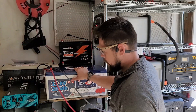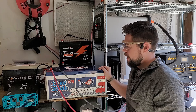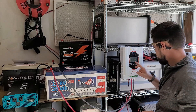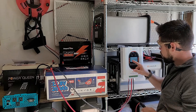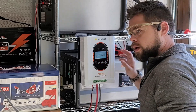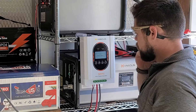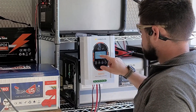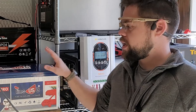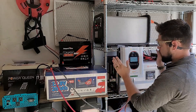Effectively, by having one — the battery — two — the inverter — and three — the charge controller — I've now made a solar generator, power station, whatever you want to call it. It's really that simple. I've got a single 200 watt solar panel connected here. On the screen I can see the battery's at 13.2 volts and no charge is coming in from the panels yet. I connect that — immediately I'm getting 19.2 volts. Now it's starting to bring in amperage: 17.5 volts at 6.8 amps, going up to 120 watts at 9 amps. I've now made an entire self-working system.